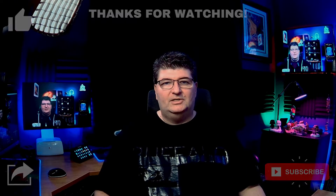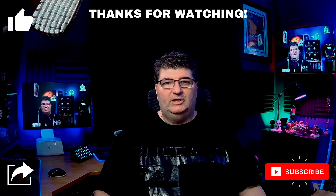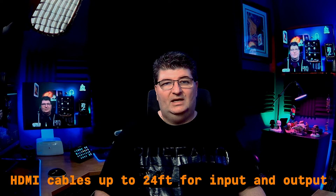I've set up a demonstration with a 4K video running through the splitter — 4K going to the television and 1080p going to the monitor behind me, taking advantage of the scaling features. I've also hooked up the splitter with a 20-foot cable on the input side and 20-foot cables on each of the output sides. I don't have anything longer than 24 feet that isn't active, so I'm not able to test beyond the rated spec. But 20-foot seems to be working fine — I had no issues getting the displays to come up, everything looks to be in sync, and the colors look to be the same.